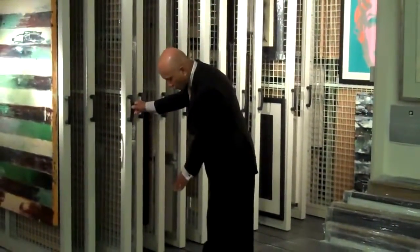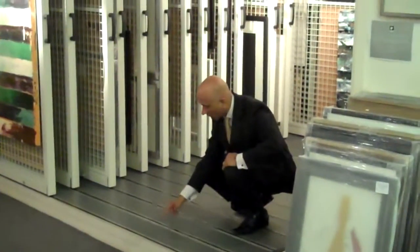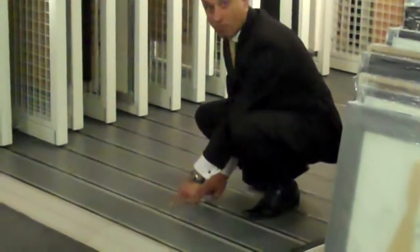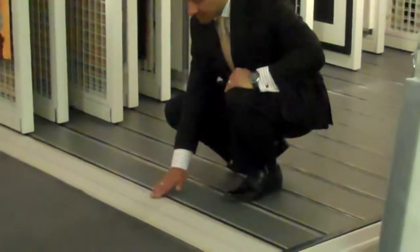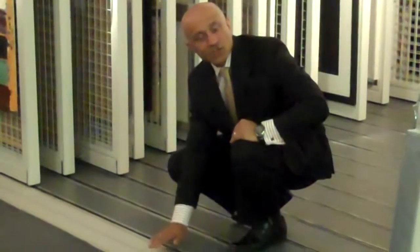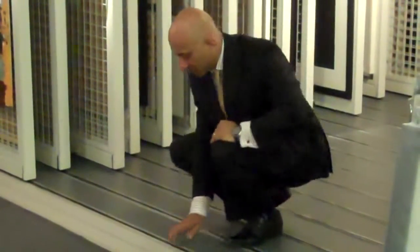The panels run on tracks set on the floor. These tracks are individually leveled, and the space in between is filled with a non-slip melamine floor infill panel, so that you create a flush and safe walkway within the system. At the front of the system we have an aluminium ramp. This ramp provides a gentle rise from the carpet finish up into where the art racking is stored, meaning trolleys, steps, or people can walk through into the system without any danger of tripping over.